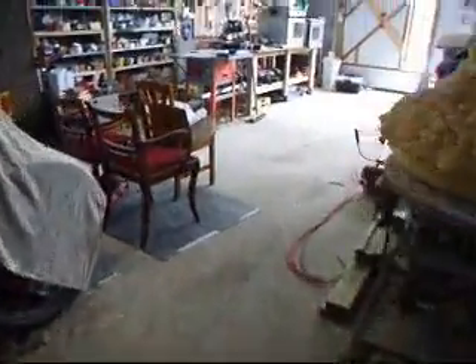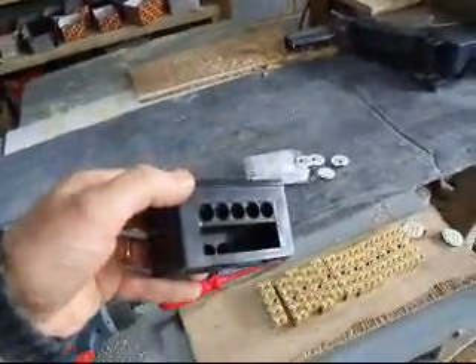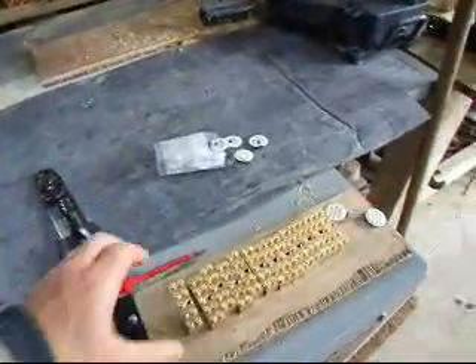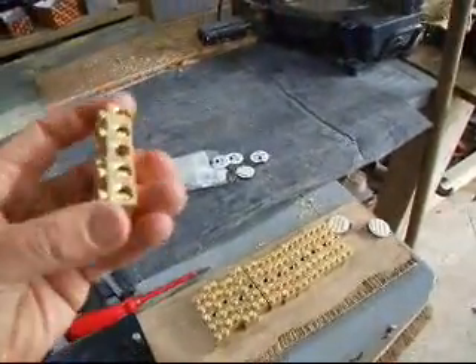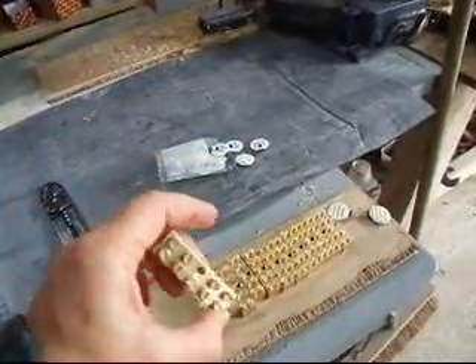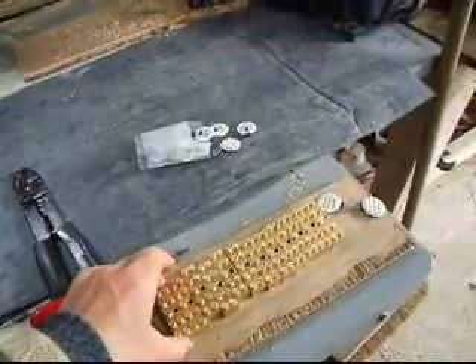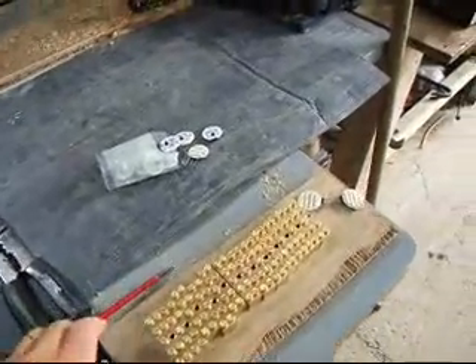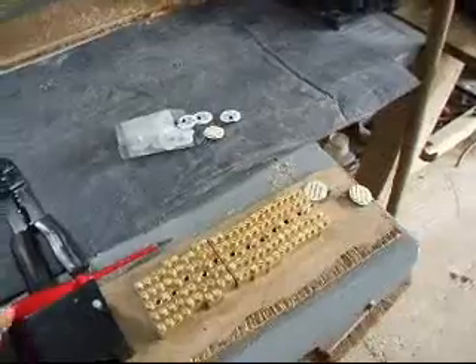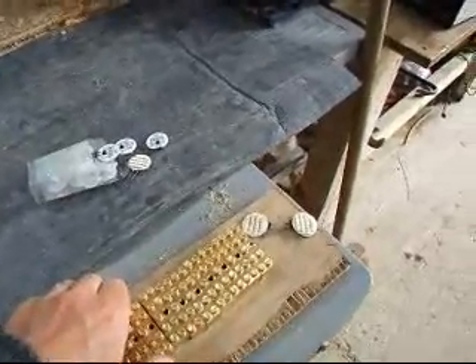Organizing connectors: I'm using the connectors from Henley blocks, which are standard mains connectors for power. We're simply taking the middle screw out and drilling a hole so that provides a fixing hole — that's for the positive. On the negative, I'm using zinc-plated earth strips. So there's the progress since the other day. I hope that our experience might help. Thank you.